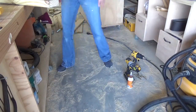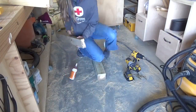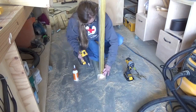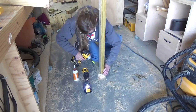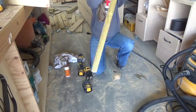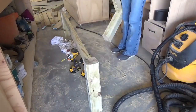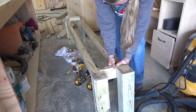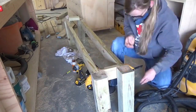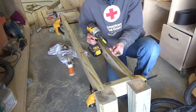The design on the bench was similar to the table, but since the spaces were so tight between the legs, the assembly was slightly different. I cut my legs just like the table with a 7-degree miter, only shorter, then cut and attached the long aprons between the legs first. After using pocket holes on the table, I attempted toe nailing the bench pieces by pre-drilling at an angle then driving the screw. That worked okay — the joints did pull tight — but the pocket holes worked a little better and looked cleaner, so I switched back to pocket holes on the second bench. Once the two long sides were together, I cut three short blocks to go between them, screwed the end pieces into the legs, and added another screw through the long apron pieces into the short blocks.